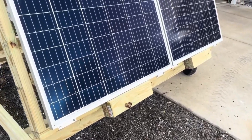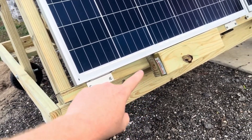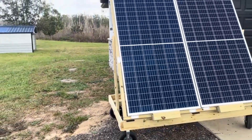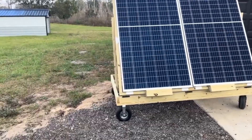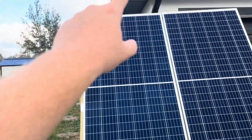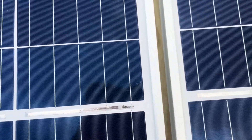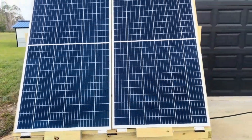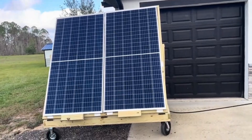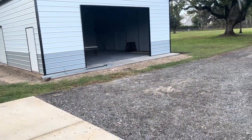This is all for science after all. What I did was, since I knew the brackets hung down below the panel, I just screwed some scrap wood flush with the bottom of the frame, which allowed me to set the panel on the frame. It basically held itself up for me while I shifted it slightly to drive the fasteners into the frame to hold it permanently. So I have frame mounts on the bottom, on the top, and then one on each side — none in the middle. I did give myself room to theoretically mount one there, but I opted not to, just for ease of installation. This is all for science — it's all temporary, semi-permanent, just to see how efficient the panels are and have the ability to charge up the Anker while all this construction is still happening and I'm figuring out where I want to set things long-term.